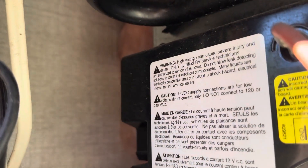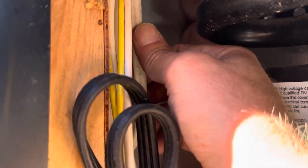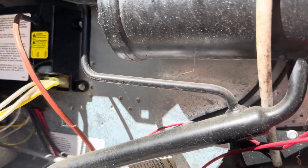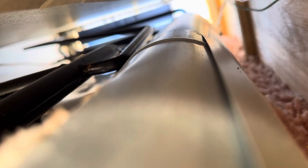You could even go in on this side — they're actually using that as a chase from the manufacturer. There's a wire chase right there that the OEM used to route wires from overhead back down to the electrical panel. Either way you want to go on the side, just keep it clear of all these lines — your refrigeration lines and the coil is up in there. There's the view I was up top for a while ago. You can see the sunlight coming in where I got the cover off. You can see the coils in the center of the screen — look to the right, that's a big open cavity where you can run your PV cable. Up top is back at the sky right there at the roof — easy way to run PV cables.